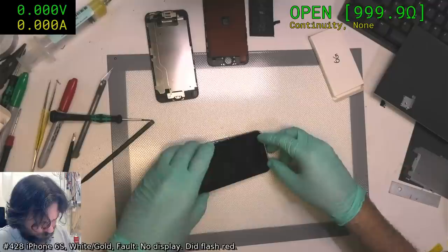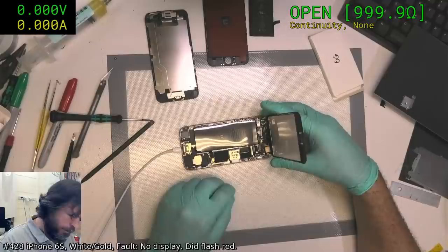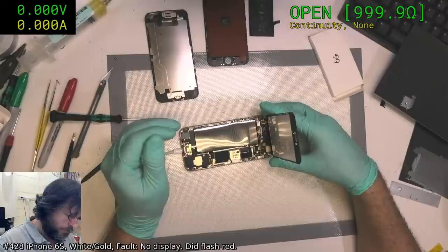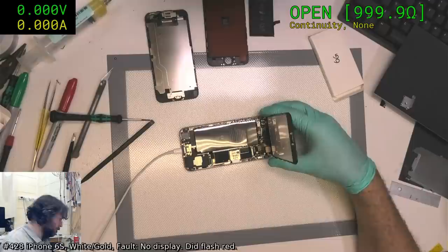I think, where's Jason Vilma when I need him? But I'm pretty sure it's Chestnut. You need Chestnut to drive the voltages on the LCD so that it can actually let the light through. But in that case, I would expect actually backlight. Having no Chestnut and no backlight, that doesn't make sense. Yeah, I'd expect one or the other, but certainly not both. It seems perfectly happy charging.